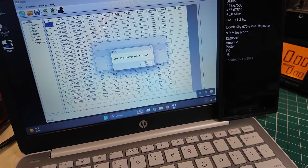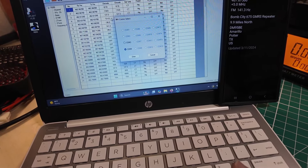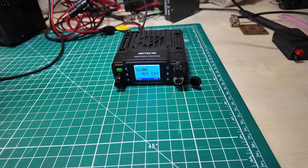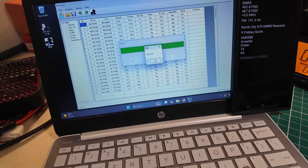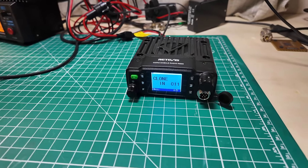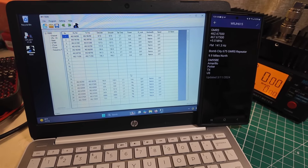Connection timeout — please check COM port. Let's exit out and go to Setting, COM Port Select — let's do COM 3, read from radio. And we are reading. Succeed! Keep on trying until you succeed. We're going to go ahead and write this out. It says 'clone in,' and we're writing channels. The radio is rebooting, and we have success on this side.